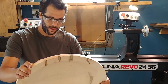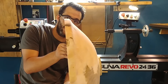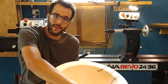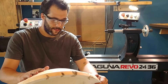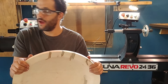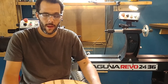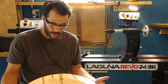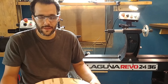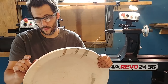Okay, so my bowl is finished in the rough. You can see the shape of the bowl — it's a pretty normal bowl. You cannot see it but there's some curl in it and I will dye it after it dries. I will let it dry for a month, maybe a month and a half, and then I will return it to make it perfectly round because I think it will move a little bit. After that I'm gonna dye it and finish it. It's 20 inches — I started with 22 and removed two inches from the edge.